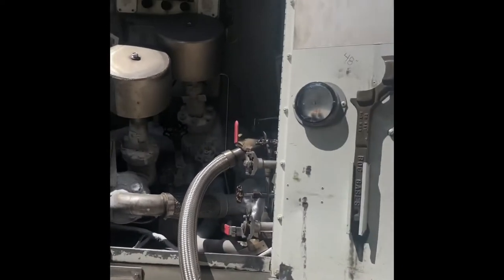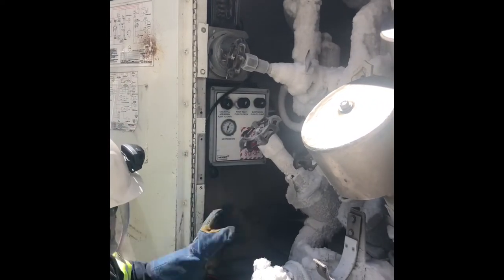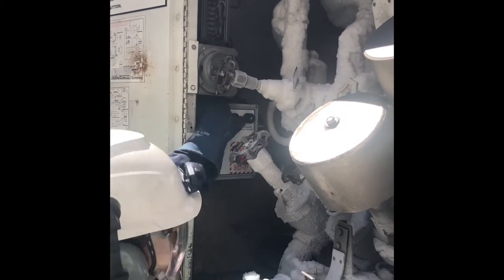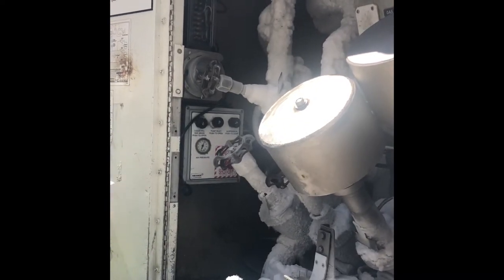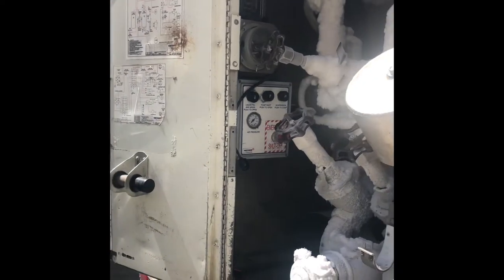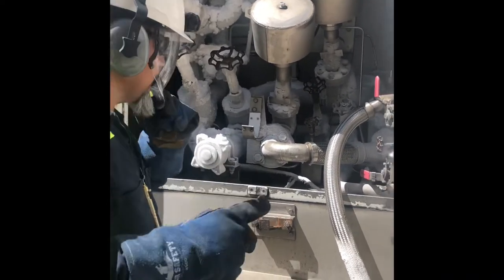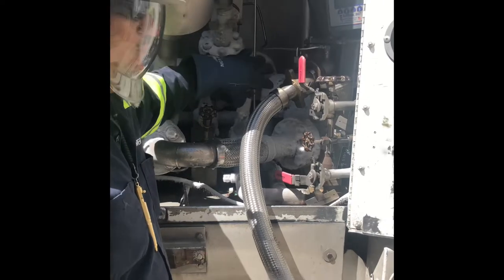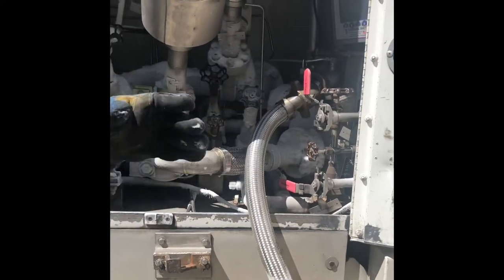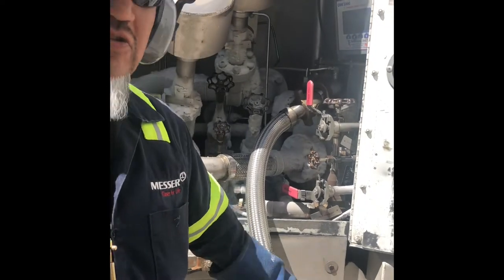You want to open up, wait till you stop. Then drop the air back. Now we open up the recirculator and the discharge valve. That allows the pump to start getting gas and then liquid. And if nothing's open, it'll throw back into the trailer. But we also want to cool these and purge it, so we can go ahead and open the discharge.